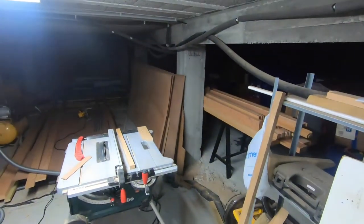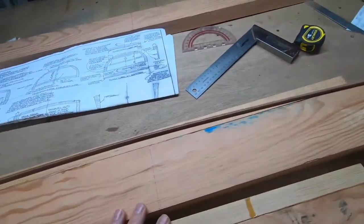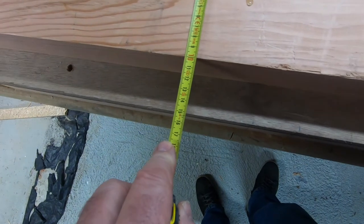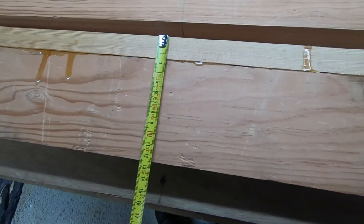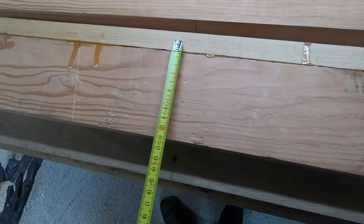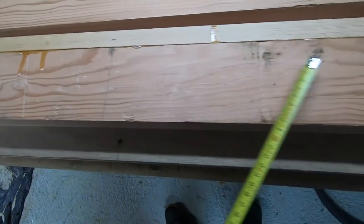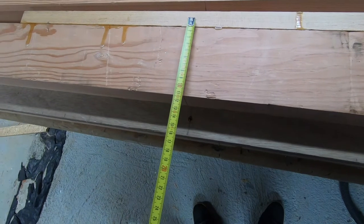The top layer will be in mahogany. So 108 millimeters, and I've ordered 100mm Douglas fir — that's eight millimeters short of what I need. I could have bought 120mm strips, but I thought I could just glue some spare Douglas fir on here, because by the time you get that curve I'm going to be using literally that much wood. This is not a structural member — it's what creates the curve on the back of the boat, so it's really an aesthetic piece.